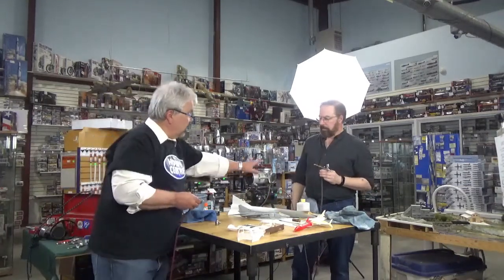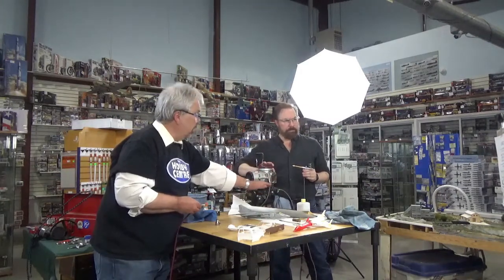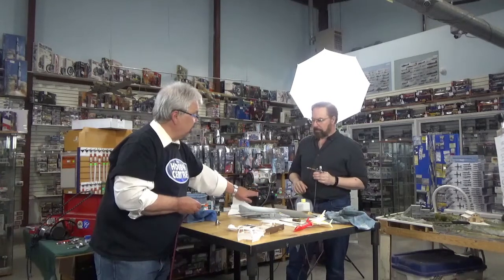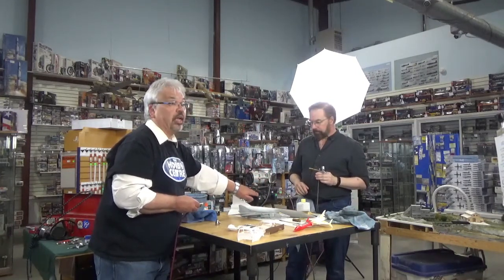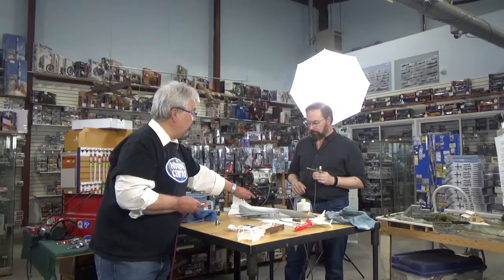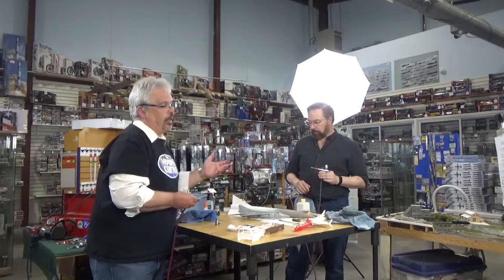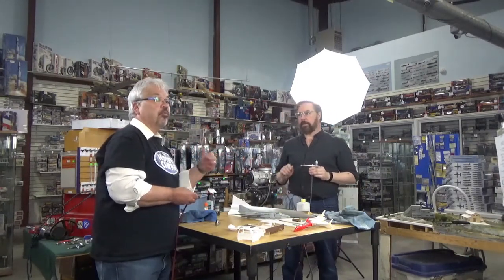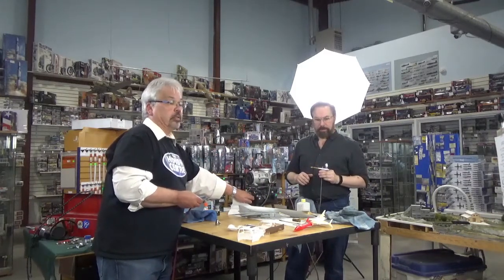Now this would be considered a straight compressor, the top component, and then this is a tank. What happens is the air blows into the tank, and then you bleed the tank out, and it only runs to recharge the tank. Even if it didn't have a tank on it, it may be an auto shutoff. But when you're doing really fine work, you might notice pulsation from the compressor, from the piston or the diaphragm, whereas when you bleed a tank, you do not have this.